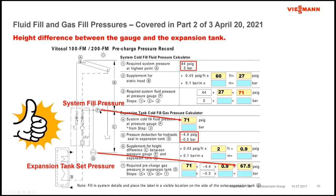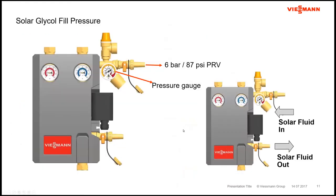The sticker documents what we started the system up with so a technician can compare it three or four years down the road. There shouldn't be a whole lot of changes in pressure between startup and years later. Regarding our ThermProtect absorber coating on the 200 FM collectors, they emit radiation from about 167°F and become an emitter at about 145°C — they won't go higher, just continually dumping that heat as a natural heat dissipation.